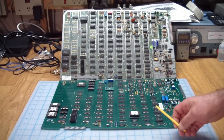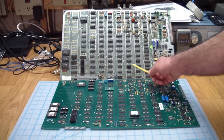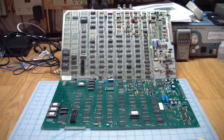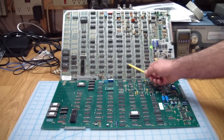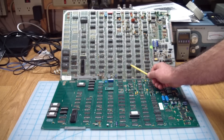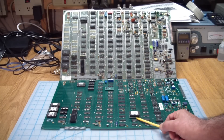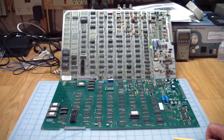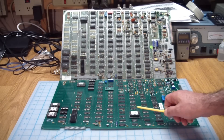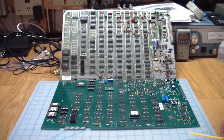Finally, we have one of the small PROMs over here, which — you can get them, but the pain with these is finding a programmer that can still program them, and they're generally not that reliable. So what he did was he built a carrier board with a 16-pin DIP plug underneath that also accepts a 2716, to solve the PROM pinout incompatibility and non-availability issues.